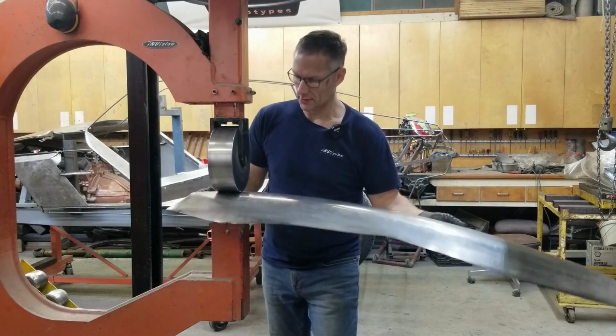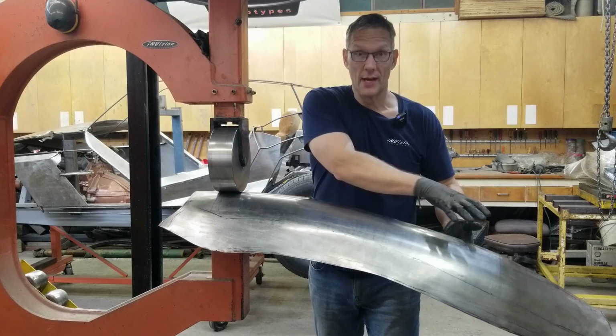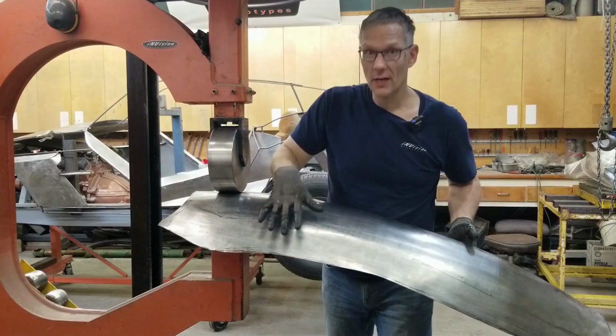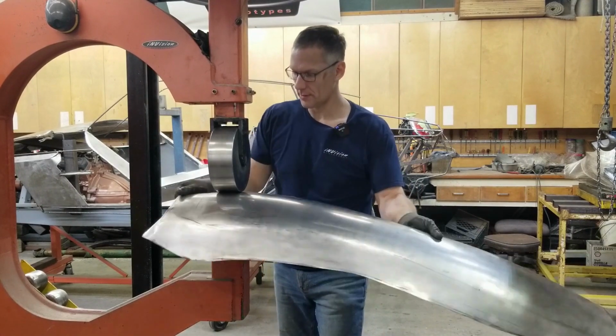Moving quite a bit of material. So the door opening is over here. There's a little flare in this area, and then it tapers back, a nice gradual curve. Now this area down here is the you don't want to wheel this area zone, because, well, I'll take you over to the car and I'll show you why. But let me give this a little more stretch.